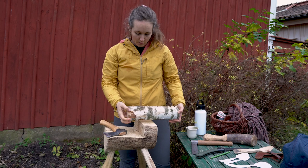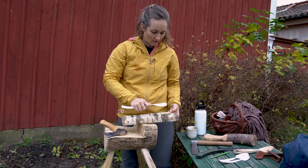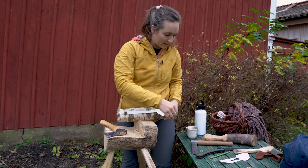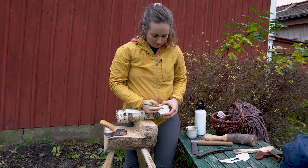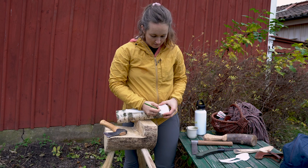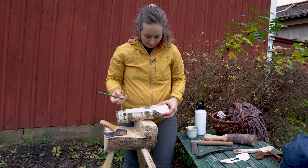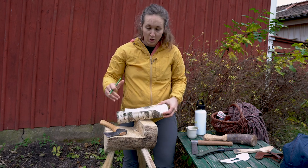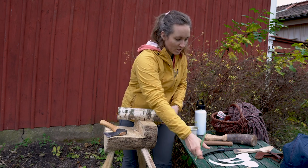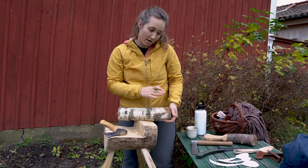So the first thing I'm going to do, I want that lowest part to be more or less two-thirds down the bowl. So one-third, two-thirds, the bottom of the second third, or between the second and third part. This is the bowl of the spoon. This is the neck area, and this is the handle, for spoon anatomy. So that's a few inches. I can eyeball it right now. That's going to be the lowest part of my crank.